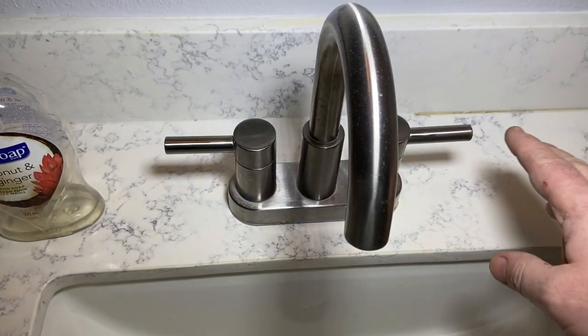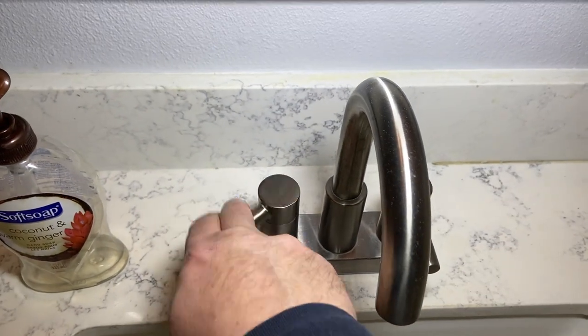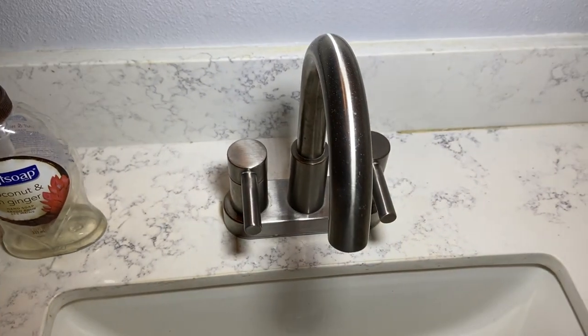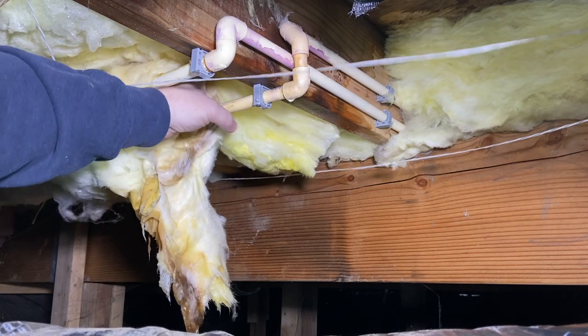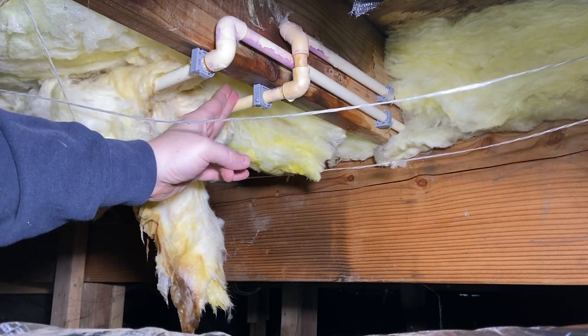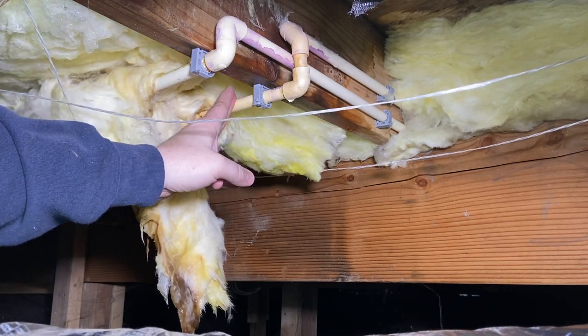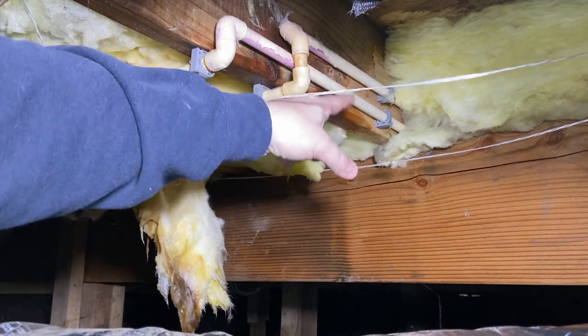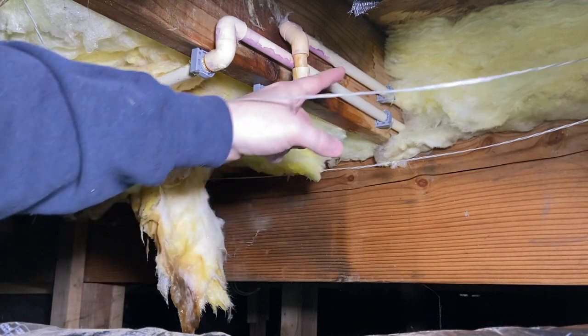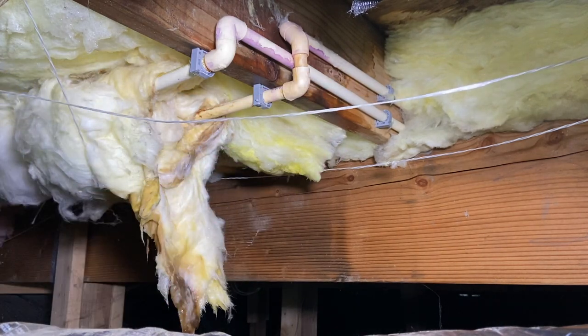Okay, you wanna open everything up, all right? Just make sure everything's there, everything's draining. We're going to the lowest point of the house. We've got this back here a little ways. We're gonna chop right here. We're gonna put a coupling. We are going to chop up there. We're gonna put a 90. And we're just gonna bring all this down and tie it together, okay?